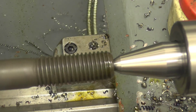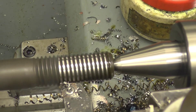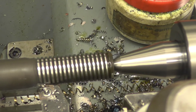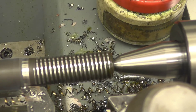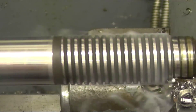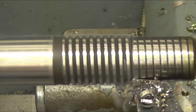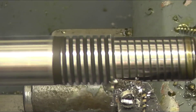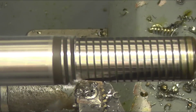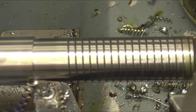Running round nice and true. Turn the threads off it now. This material is good for making pins in high stress situations, as long as you don't weld it — if you weld it you'll change the character of the metal and it'll be no good. For a job like this it'll be ideal. It machines really well — good quality material.